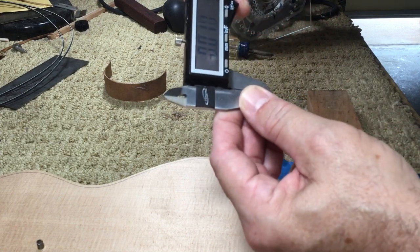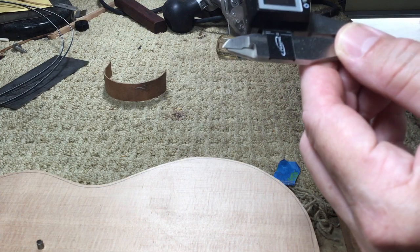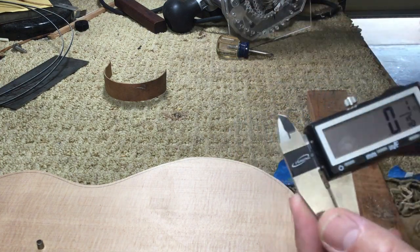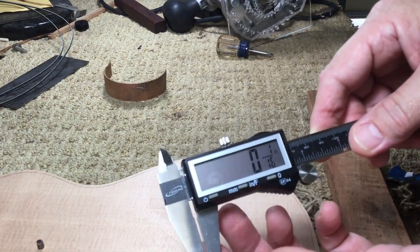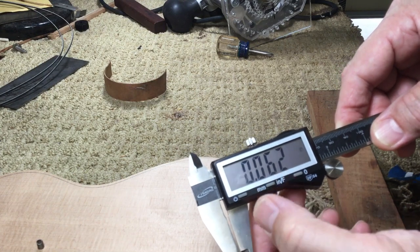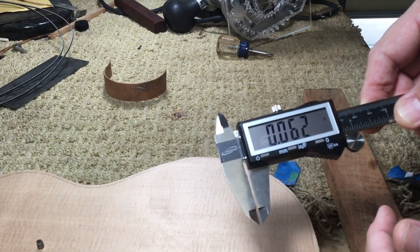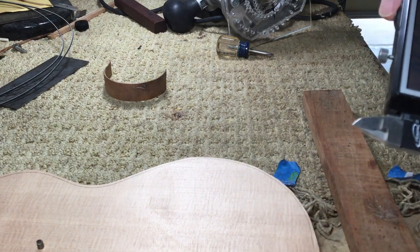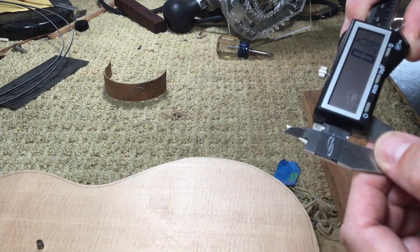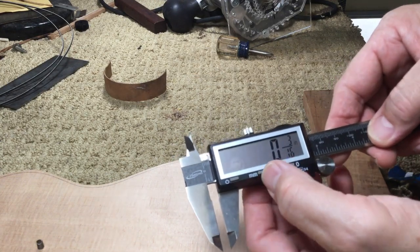Well, 1/16. If we go to 1/16, watch this. Just so you guys can see, we'll do math on the micrometer here. And there we go. 1/16 of an inch. All right. If I change that to fraction, decimal, 0.062 times 3, 186. Sometimes it comes out, sometimes it doesn't, but let's do this. So we have a 3/16 inch bit, which is right there. And we change that to fraction.